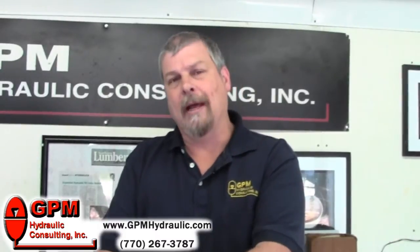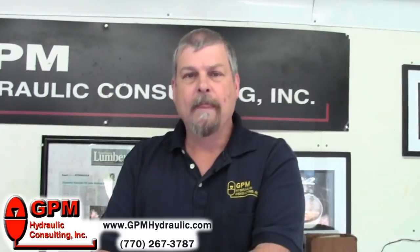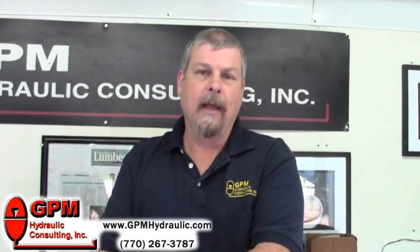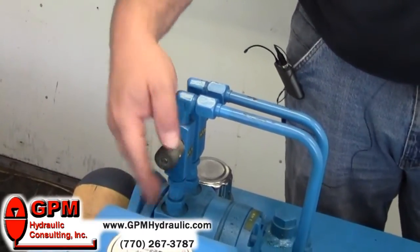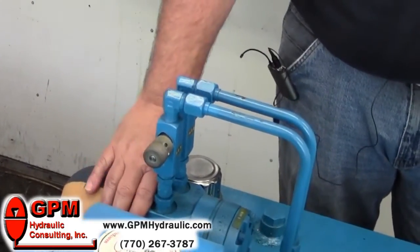So we have to isolate it. We're going to utilize our hydraulic trainer to make these adjustments. We have two flow controls installed on our hydraulic motor that we're going to use for isolation. A hand valve can be used, or sometimes you simply have to disconnect the line and plug the line off so you're not rotating your motor.